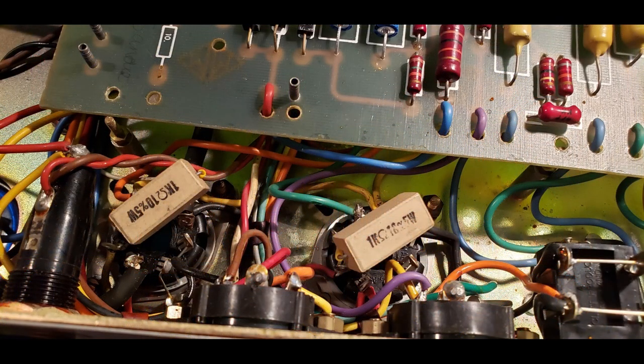Okay, we're moving to the output tube sockets as the amp came in. There's some discoloration on the chassis between the output tube sockets. And the 1K 5-watt screen grid resistors did not seem original. Or if they were original, they had been removed at some point and then put back poorly. There's a couple dodgy solder joints on the output tube sockets. And the amp originally did not have any grid stoppers on pin 5. And going to the cascaded gain is going to increase the gain of the amp substantially. So grid stoppers really are your friend there. They keep a whole bunch of noise and oscillation and outside interference from getting into your outputs. So it was a no-brainer. Some Pyre 5.6Ks were on order.